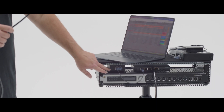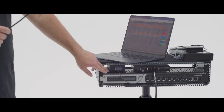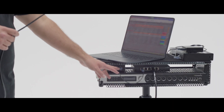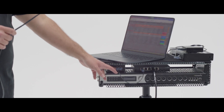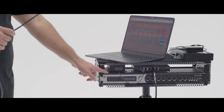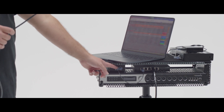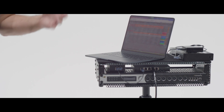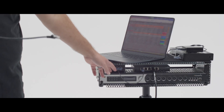This network switch is powered via ethernet — it's a PoE-powered switch. But there's an extra piece of gear in here. Take a look at this — this is called a PoE splitter, and it's connected to my PoE switch. This PoE switch is going to provide power and data to the splitter, and on the back I've got a cable that converts that ethernet connection into power for my Mio XL — just like you would plug a normal power supply into the back of your Mio XL.